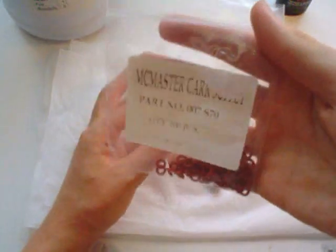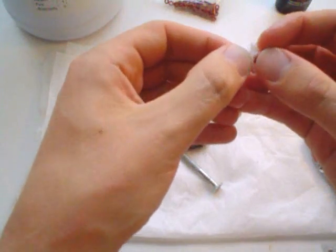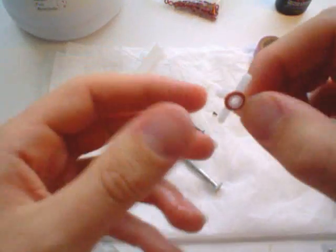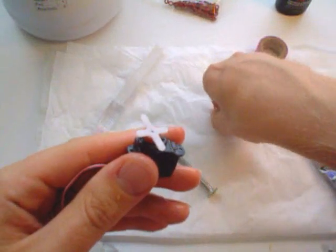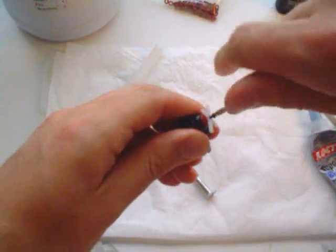What you want to use is what's called an o-ring. I get them from McMaster — you get a pack of a hundred, really cheap. Take an o-ring and push it over your output shaft. Then get a second o-ring and push that ring over as well, so you have two rings. Push them both together on the top of your servo. You have two o-rings and the servo horn. Then put your screw back in for the servo horn and screw that all in.